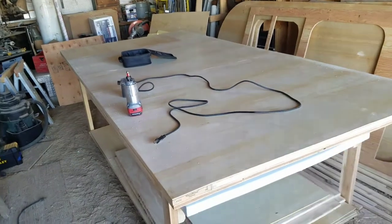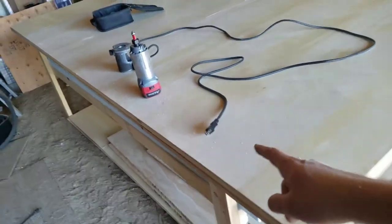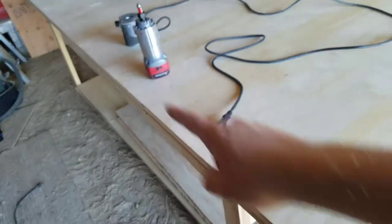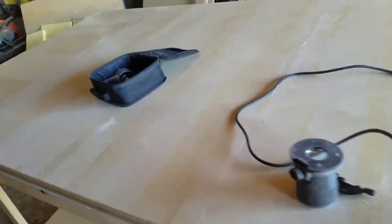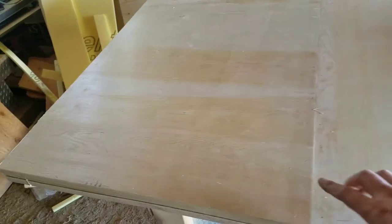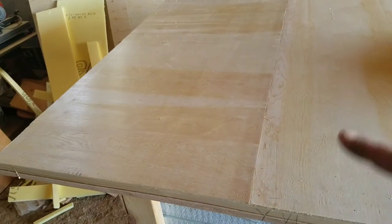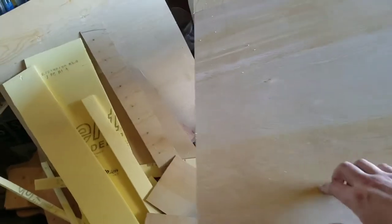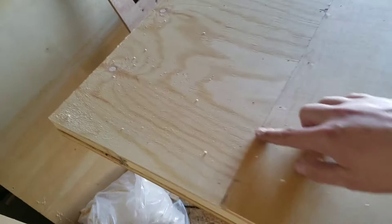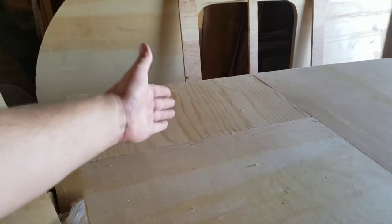And here we go — we now have a floor! I am very happy about this. I can lay on it, I can walk on it. What I did here is take two four-foot wide by five-foot long pieces and put them side by side, nailed and glued down. Then I had a scrap piece and I didn't want to cut a full piece of good plywood just to reach all the way across, so here I've got just a little foot-wide piece at the end — which is perfectly fine. The plan is to have some kind of pull-out there for the stove anyway, so nobody will ever see it.